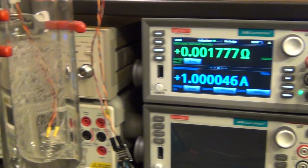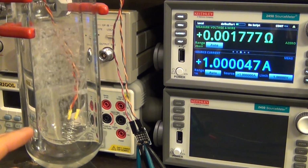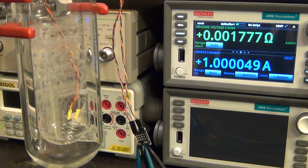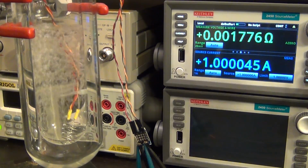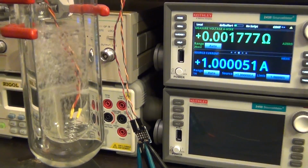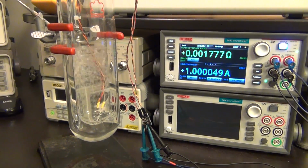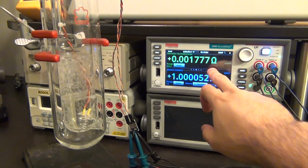There's no challenge whatsoever. And in fact, if you know the resistance coefficient of this particular metal that is used, you can actually measure the temperature directly in there. You can program that into there and find out what the temperature is by using this mechanism. It's not the most reliable way. Of course, the thermocouple is better. But I thought, hey, we have liquid nitrogen, we can play with it and find out what we can do. And look, no problem, we still have many more digits.